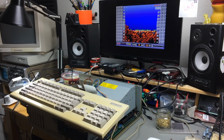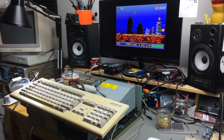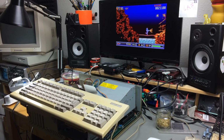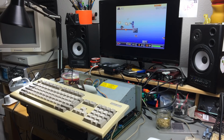Yeah, we had this running for some time now, and it didn't explode, and it doesn't smoke, and it works. So that's good. That's actually very, very good. So yeah, let's measure the capacitors there, and see if there's any broken ones or leaky ones in there. Actually, it seems like it's looking better. The cleaner the power supply is, the better this is going to work, and the less distortion you will get in the picture, and noise in the picture, and in the sound actually. So yeah, this worked out pretty nicely, I guess.